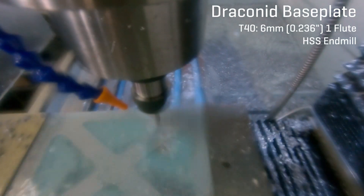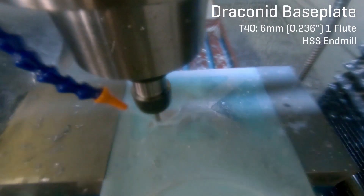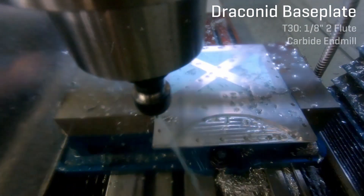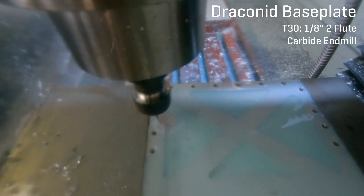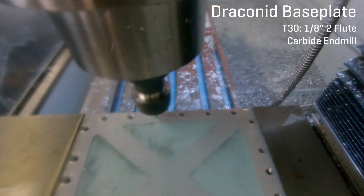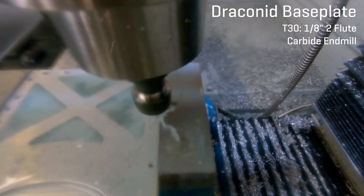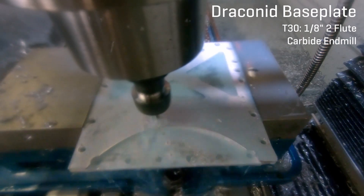But a few days ago I finally spent the time needed to wire up the electronic tool setter that another member of the makerspace had bought. Now I can get every single tool length set within about a thousandth of its actual length with very minimal effort, and it shouldn't be a big deal to swap tools in and out of the tool holders. Previously I had to manually take a piece of paper, jog the tool down one thousandth at a time, rubbing the paper back and forth until the tool caught it — that was how I was zeroing all the tools. Every single time I needed to zero a new tool, I had to swap to a known tool, set Z0 with that process, then swap in the new tool and do the same process again just to get the tool length.